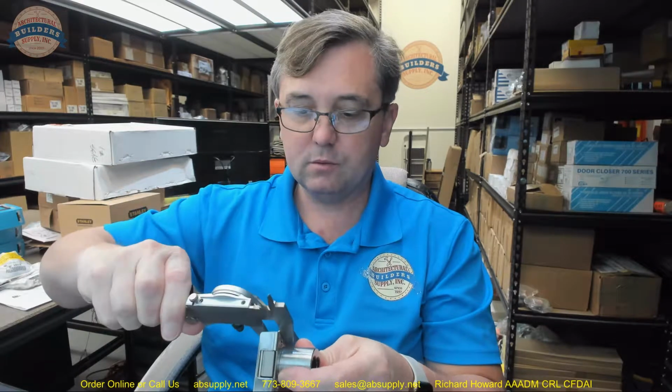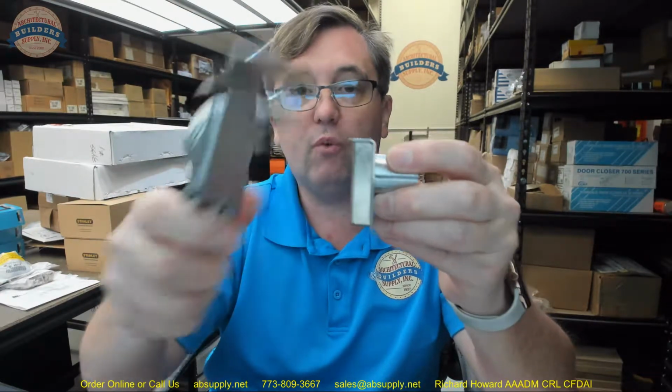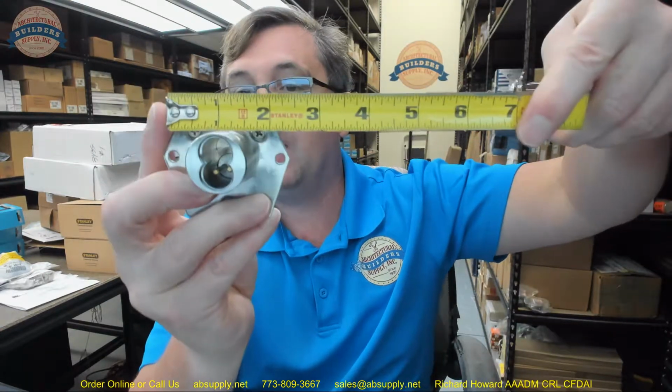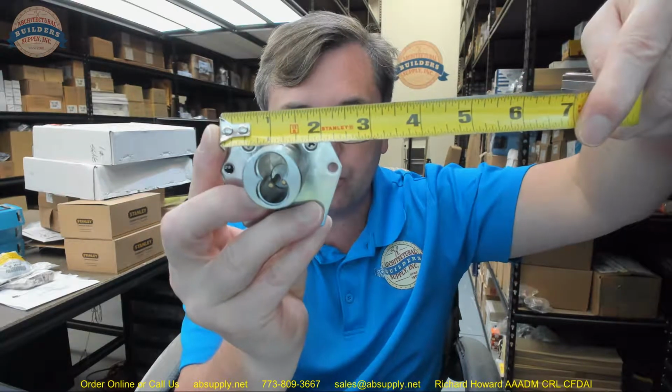They must be meaning this. Yeah, they're meaning the body thickness. When I put my caliper onto it, it's basically 1/2 inch, 0.475. Okay. Length 2 1/8, width, thickness, hole spacing 2 13/16. We didn't take that dimension. Kind of eyeball it there on the camera, if we will. 2 3/16 is what they say. I would certainly see no trouble with that. Cylinder diameter 1 1/8. That we didn't take yet. 1.124.